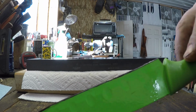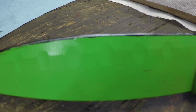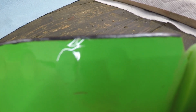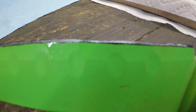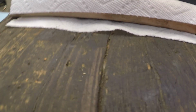Now you can see, turn you around so I can see what you're seeing. All right, see where that shininess is? And see how I did a pretty good job of holding that angle throughout the entire stroke? Okay, so you can use this to tell you, okay, well, that stroke matched the factory angle pretty well.